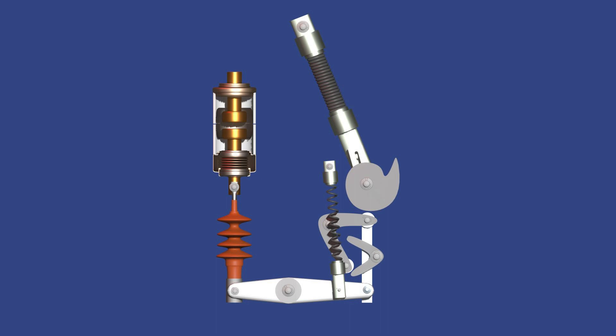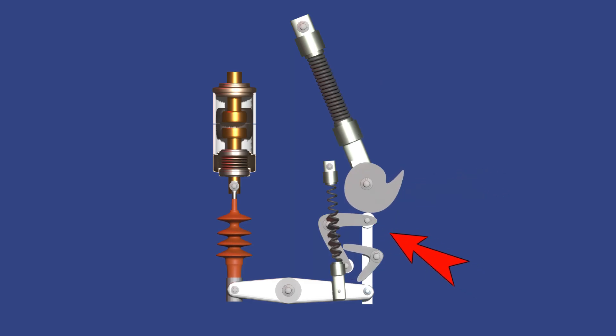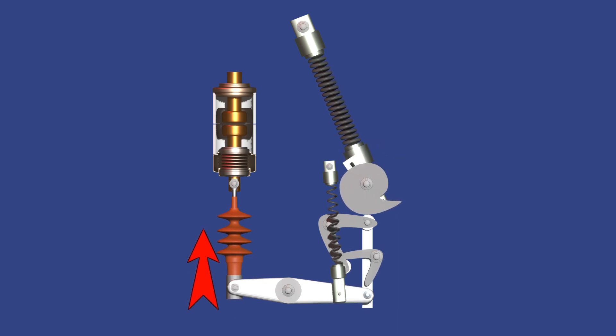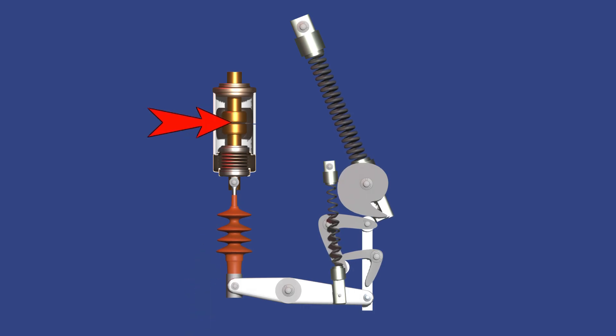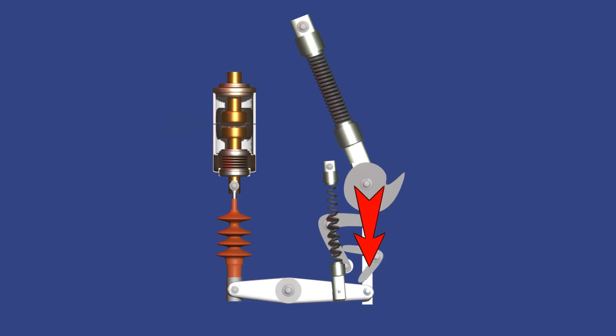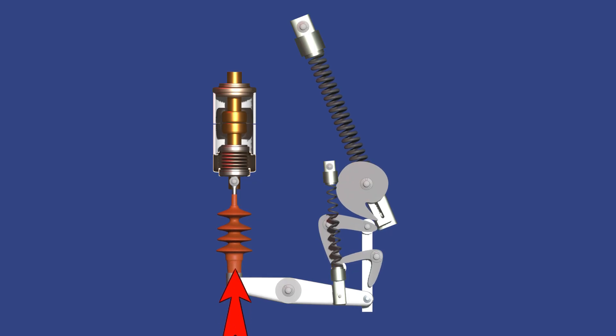You should remember that the charging of the closing spring is not related to the open or close condition of the circuit breaker. Here, the breaker is now in open condition. If we apply the close command to the breaker, the plunger of the closing coil makes the hook remove the latch of the closing spring. Therefore, the closing spring expands — it rotates the cam, moves the roller, and one side of the lever moves downward. Therefore, the other side, after the middle hinge of the lever, goes up, thereby pushing the insulating rod upward, causing the moving contact to touch the fixed contact and close the circuit.